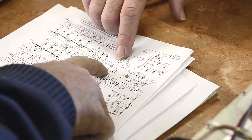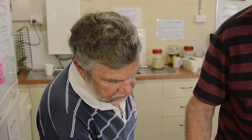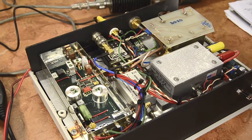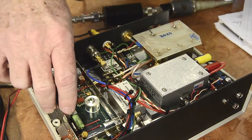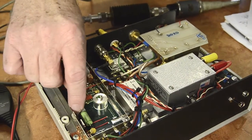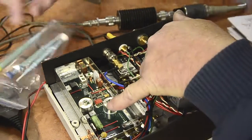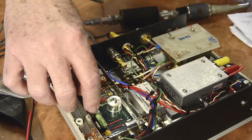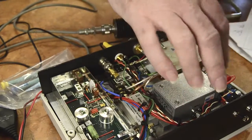You should be able to wind the wiper down to ground one way and max the other if you just want to meter it. One's transmit and one's receive — find out which is the transmitter. This is the TX one, the one that says TX gain. We're going to turn that right down so that there's no power out from there.